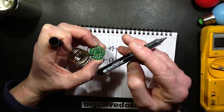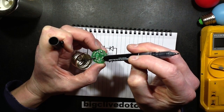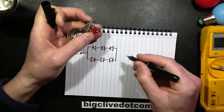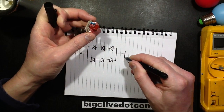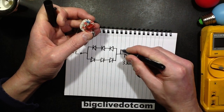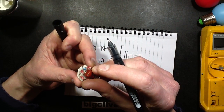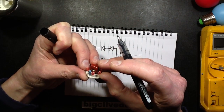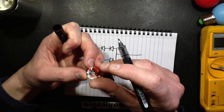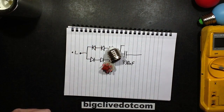I take it they are just bridged together at the other end. They're linked through that, linked to that — yeah. And then it's just the capacitor, 330 nano, with a 560k discharge resistor across it. Hard to tell — its bands are very small. It might actually be 680. Let me check with a meter.